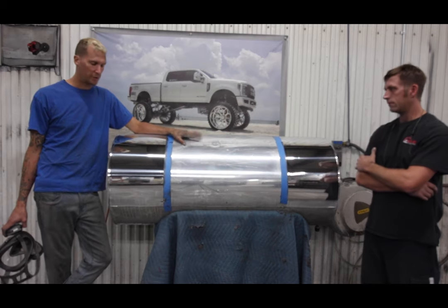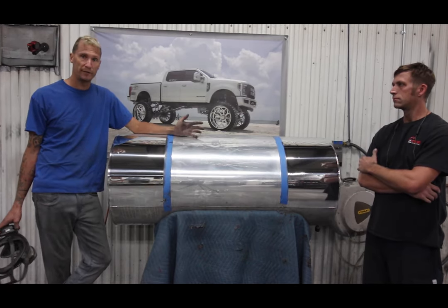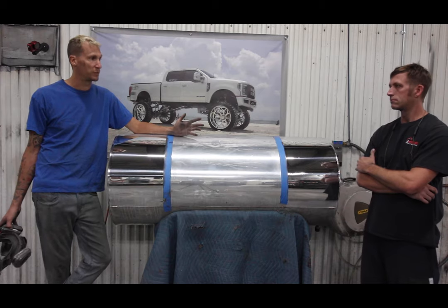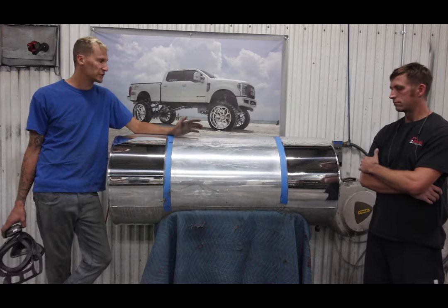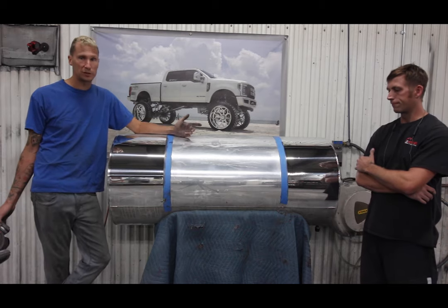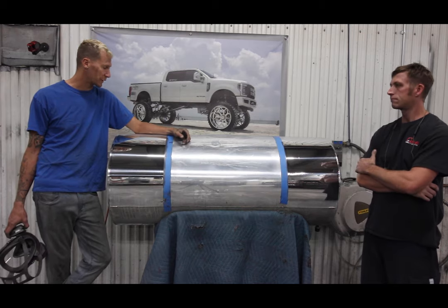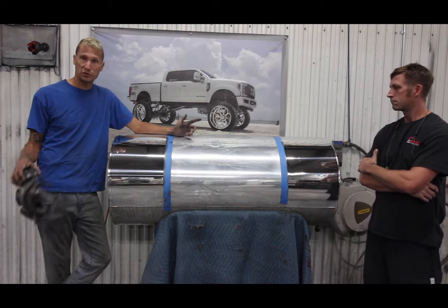But with the variable on something that's a little rougher, I would have definitely started with a red stiffer buff with a brown compound just to kind of get where I wanted to be to match what I would be getting with a 6,000. Right. Still jump straight to the yellow with the green to color, but I would have started stiffer for the cut.